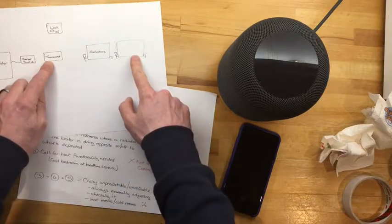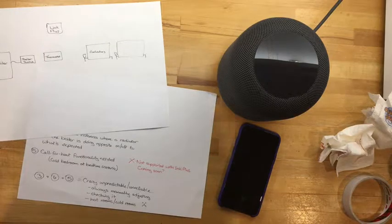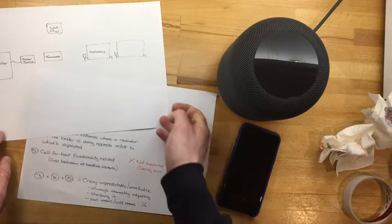So the radiator that's in the bedroom is never going to get any heat, even if its thermostat is needing it. So the only way around it seems is to manually go in and artificially tell it to heat the living room even more, just so you can get some heat to the bedroom, even though it's a time that you're wanting the living room to maybe just cool down because it's the end of the day.